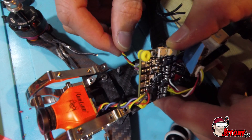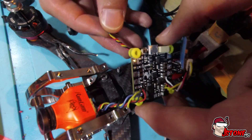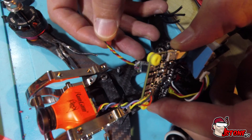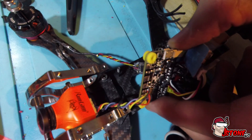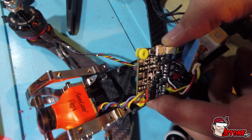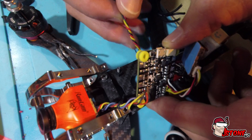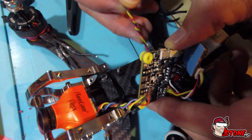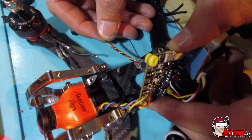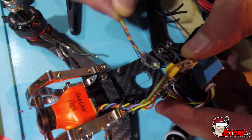So if this works for you, feel free to take a look at my other videos and throw a like and subscribe. So what we have here is both the R9 and the Taranis, set with OpenTX 2.2.2 on the Taranis X9D Plus, and the latest firmware as of September 2018, the F port firmware from the site. This has been flashed with the latest firmware, and you can see it just under here.